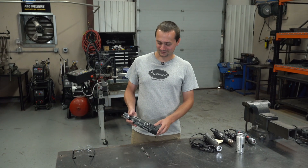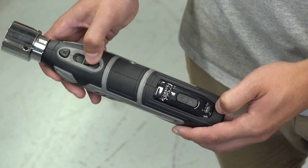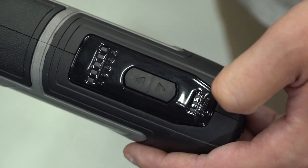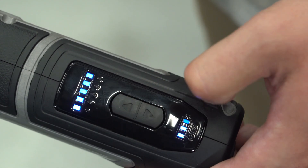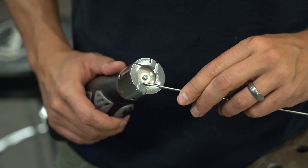Now let's dig into this thing. It's got a really nice slider on-off switch, really easy to hit with a gloved hand. When you turn it on, it defaults to speed setting 3 — that's a real nice speed to just sharpen a tungsten and give it a nice touch up. Now if you really need to get into it and start from scratch, you can turn it up to speed setting 5, which gives you the full 35,000 RPM and really lets you remove some material.